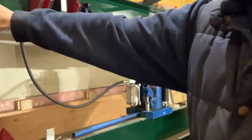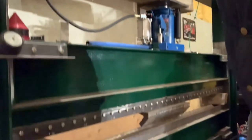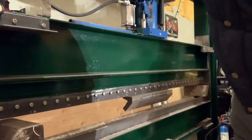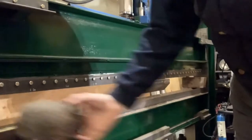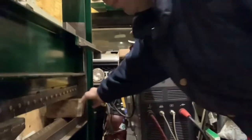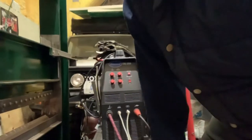So if I lift this up, I may get the press brake coming up — I might need a bit more air pressure. There we go, that's lifted it off of my stop blocks. I'll take my safety blocks out and we should be good to make a test bend.